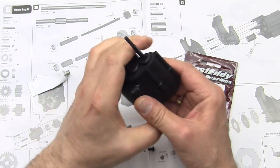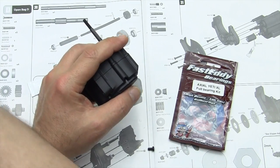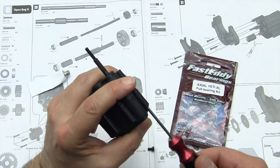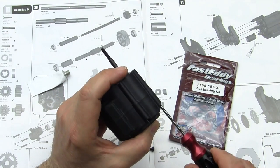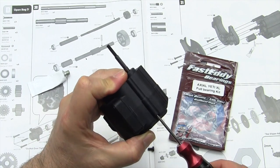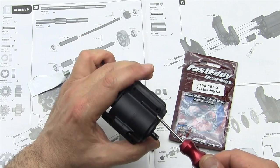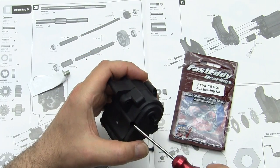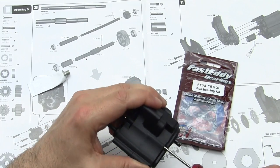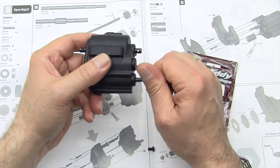I had that clutch set really loose and it actually did not tighten the screws all the way down, which is fine because you don't want to over tighten them. So we'll go in and finish them off by hand. Screw that in just till it touches. And we're just watching the gap here till it closes. There we go. An electric screwdriver is nice on something like this because you can get the screws most of the way in, but it's really not preferred to torque them down with that. You want to do that by hand so you don't strip anything. So I set the torque at the lightest. Okay, that's in. Let's go ahead and turn everything, make sure nothing's binding up.